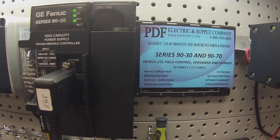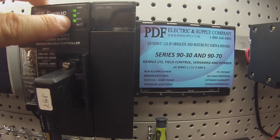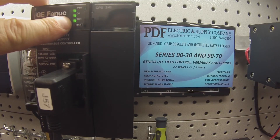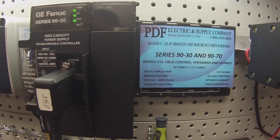If this processor is giving you a problem, or you think it's a problem processor, I'd leave this running overnight or over a weekend. When you come back, the processor over 24 hours or more should still be in run mode. If for some reason it kicks itself out — if the LED is off when you look at it again — go into your software under Target and into Diagnostics, and the diagnostics will illustrate exactly what happened. I hope this helps. Thank you.